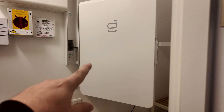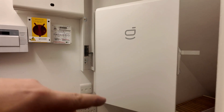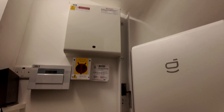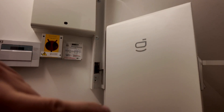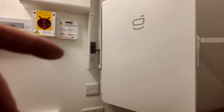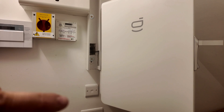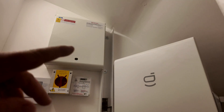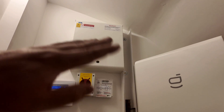Obviously that's all limited by the switch fuse on the grid side. When you're blending the gateway, you need to think that yes, you've got 63 amps that can come in from the grid, but you've also got that 10 kilowatts that can come from the Sigenergy store — so you could still have 100 amp consumption at the consumer unit. You need to size your tails accordingly from that backup port. Don't just think the grid has 63 amp supply so the backup port only needs 16mm cable — your Sigenergy store can also input power which can be drawn by the household.